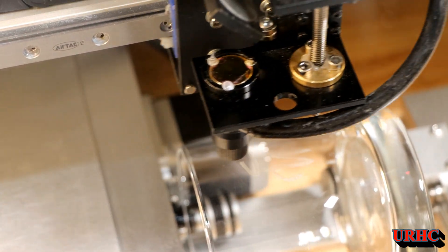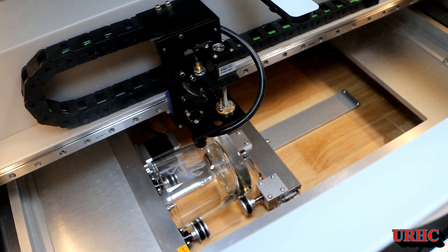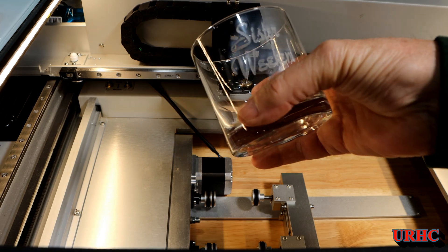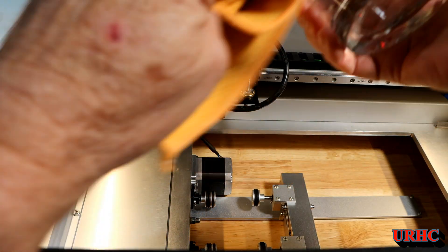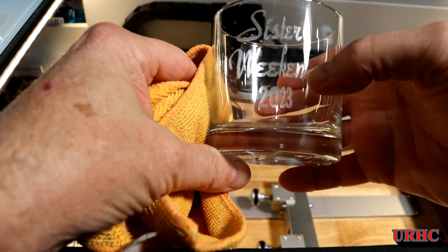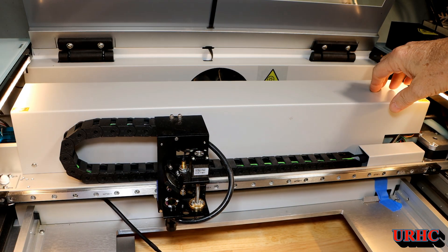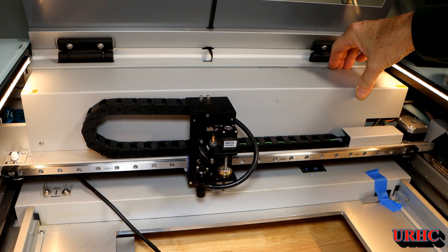I'm getting a really beautiful burn — just like a frosting without any really big chips on it. I played with a couple of different settings and I like this the best. But on this test glass, you can see everything shrunk down on it — it slipped on the rollers. The heavy end of the glass was on the undriven roller because of the way you have to adjust it, and it slipped.